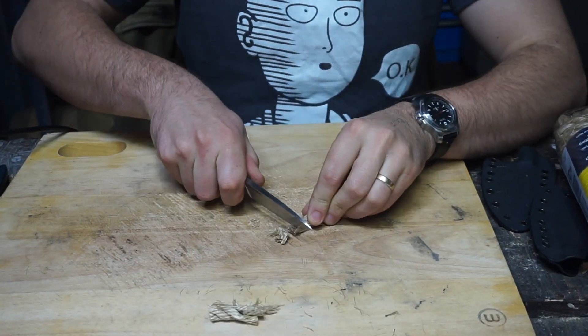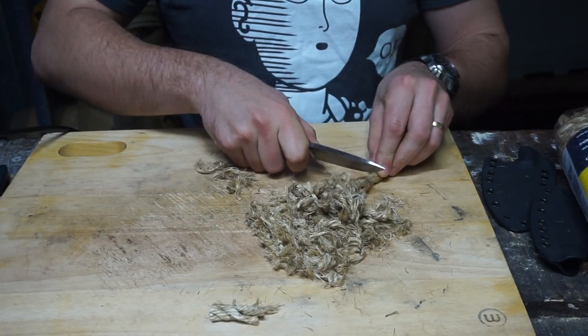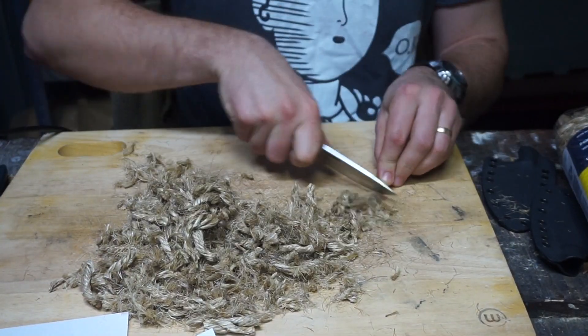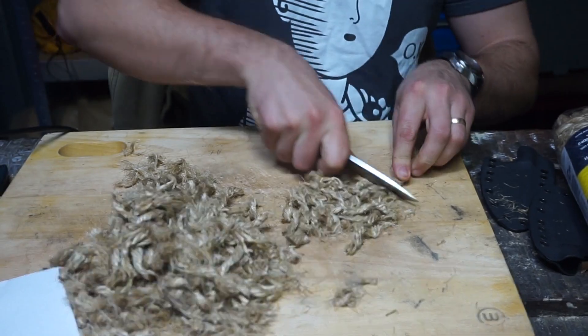So I got to cutting with the Z-Finite first. I found that it cut through the rope 230 times before it no longer bit into a stiffly held piece of paper, which is my benchmark for when to stop the test. I've run out of arm hair if I did the arm hair test — I do a lot of these. That was a very cool result, about what I was expecting — about the same as mid-tier or low-tier powder steel. This is an electroslag steel, by the way, so it's not even a powder steel.